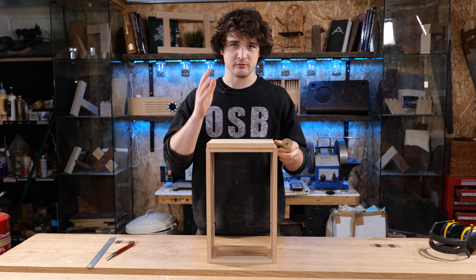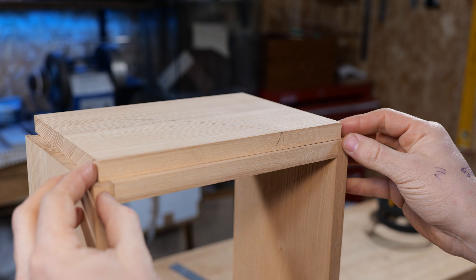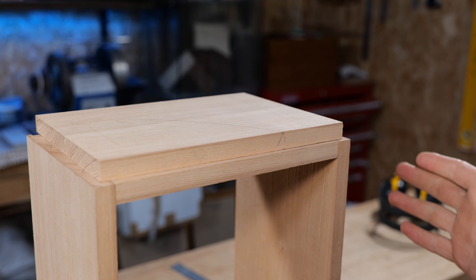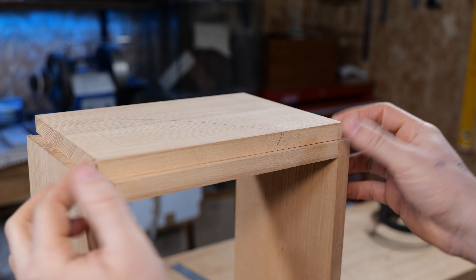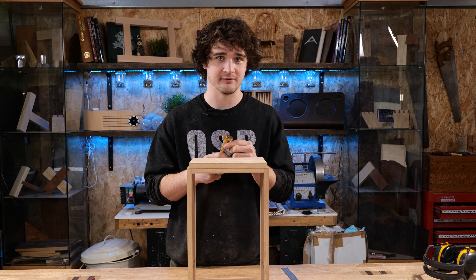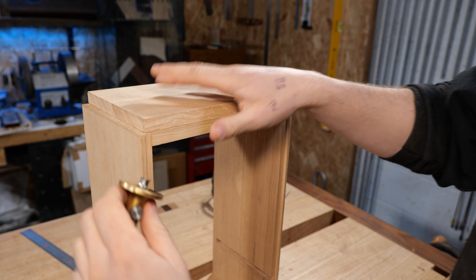The next job is to start scribing the shoulder lines around both ends of this shelf in order to make the tongue. Don't just set your marking gauge to the dimension listed on the working drawings, because it may make your shoulder lines too long or too short. The shoulder lines on the shelf need to be exactly the same as the shoulder lines on the dovetails. If they're a bit too long, the sides of the cabinet are going to have to bow out around the shelf; if the shoulder lines are too far in, the cabinet will curve in to close up the shoulder lines on the shelf.